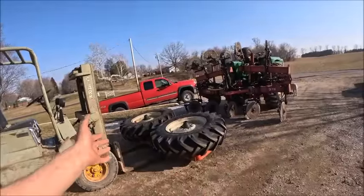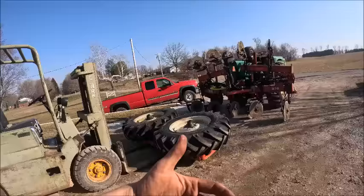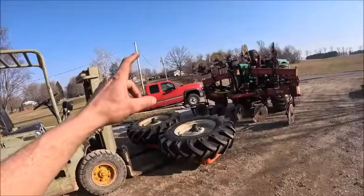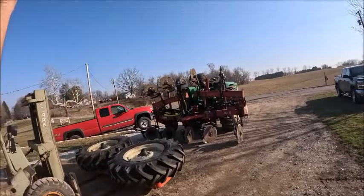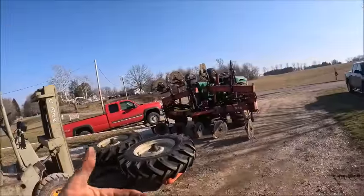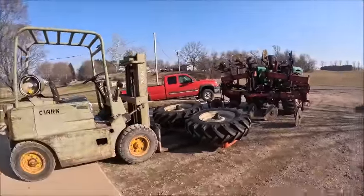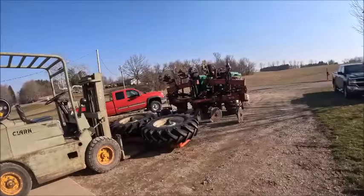So anyway, long story short, 125 minus 1/4 inch aside, 124 1/2 is what we've got to cut the axle at. So let me get this out of here. I can go get the toolbar unhooked at the farm, and we've got to get to 16 so I can grab that H-beam, because it's down where we can't get at it with the forklift. We'll get that cut, and that'll pretty much be the end of the day because we'll be waiting on steel at that point.